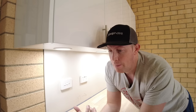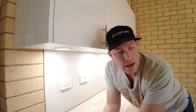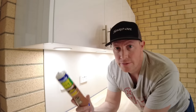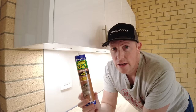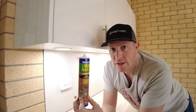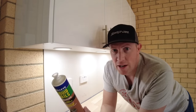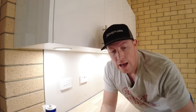I've done some of this externally where I used a big bucket of tile adhesive to save money, and it worked really well. But working on brickwork and plasterwork gets messy, so for this job I'm using Selly's Liquid Nails Landscape for Bricks. Since I've got a mix of brickwork and plasterwork here, this stuff works really well. It's about $12 a tube so it is pricey, but I use it pretty sparingly. You'll need a caulking gun for it.